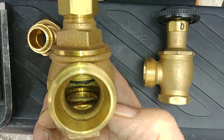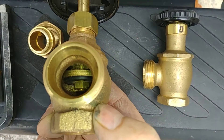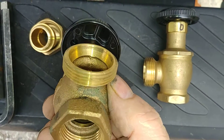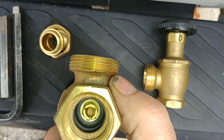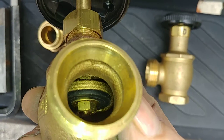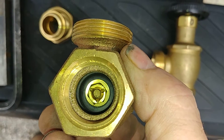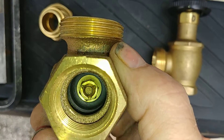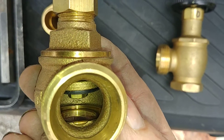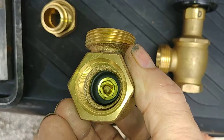As you can see, the space is fairly wide, lets in a good quantity of steam, and it's really not optimized for throttling, but it can. The material that shuts against the seat is, I think it's EPDM — ethylene propylene diene monomer rubber — which holds up reasonably well with steam, but it does crack and fail after a decade or so in service.